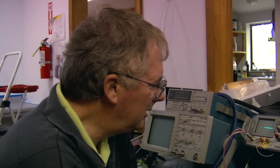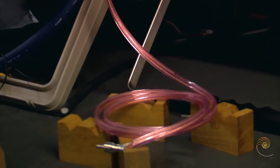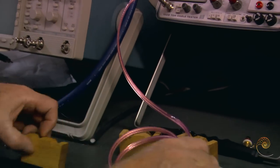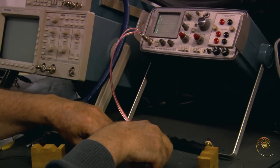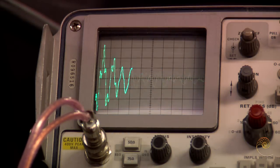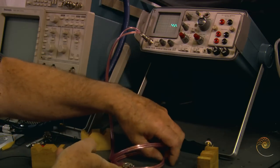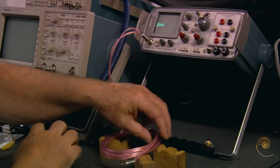Here what we've made is an unshielded cable — just a basic pair with no shield. And to demonstrate the involvement it has with the environment around it, what I've done is propped it up on these blocks. And if you pull it out — bingo! As you see, the proximity of surrounding surfaces involves dielectric in the equation. It doesn't have to be part of the cable in order to be involved. It can be the sofa, the floor, the concrete surrounding you, whatever it is.